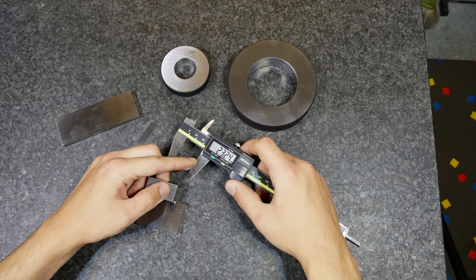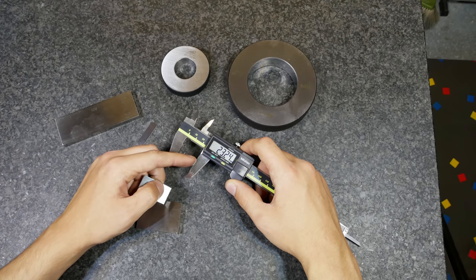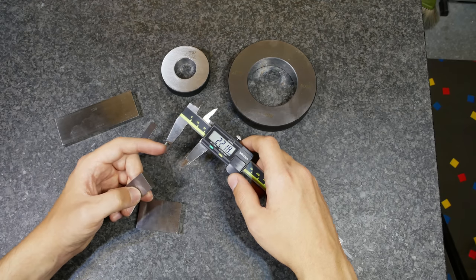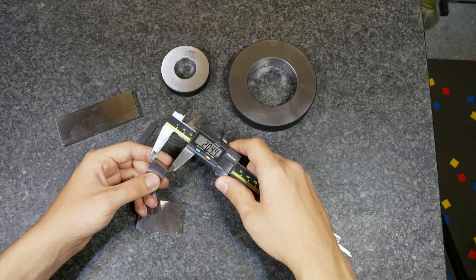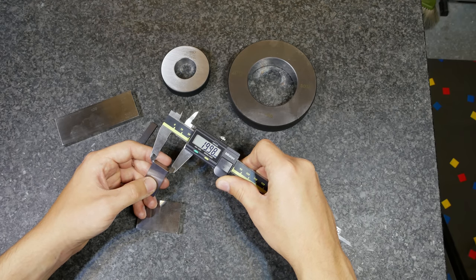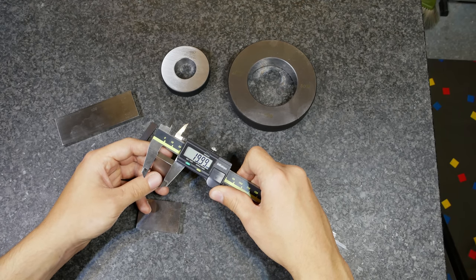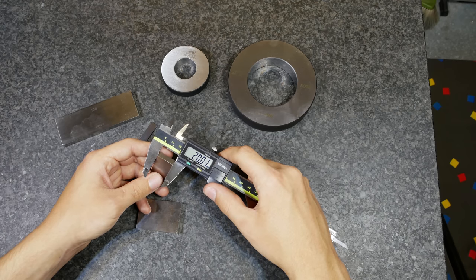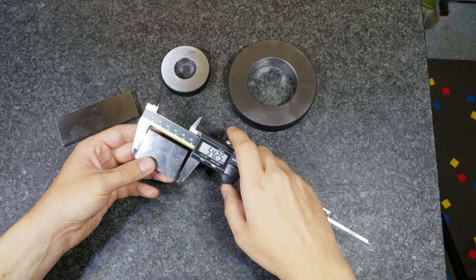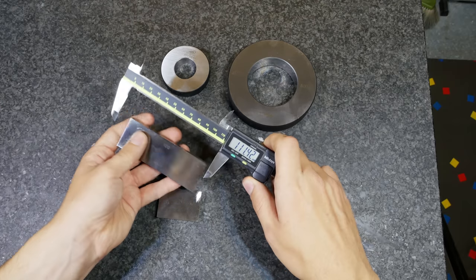I also try to use the inner area of the measuring surface and not the tip, because you're not so far away from the linear scale on the caliper there, and that will make things more accurate. It's also not so sensitive to the pressure you apply with your thumb. For example, when I try to measure this 20 millimeters with the tip I can get the value, but when I increase the pressure I can easily go under. When I do the same on the back and apply the same pressure, I can also get an under-measurement but not as much. Some other dimensions like this 50 millimeters are easy to measure, and here a really big one — 100 millimeters.